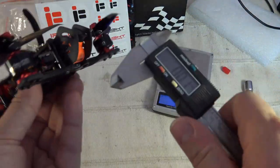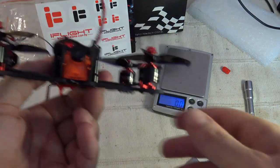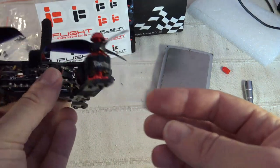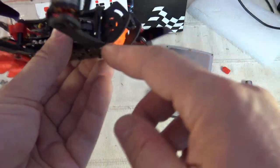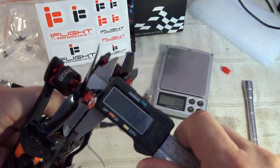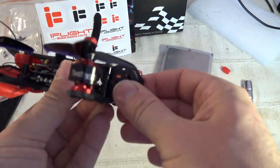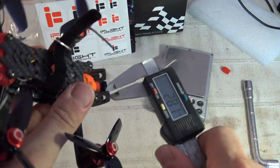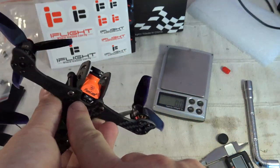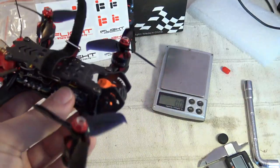We have 3 millimeters carbon arm with this profile here and the extremity to absorb some lateral shock. Here with some aluminum standoff, we have this 2 millimeters upper carbon plate in case of crash. And you can see that the camera holder, the carbon one, is also 2 millimeters, and is held by the bottom side thanks to these two carbon notches, and attached as well or maintained via the upper structure.